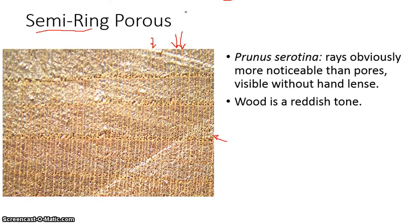Look for these rays that are almost blocking the view of your pore pattern, but once you look past the rays and see the pore pattern, semi ring porous means that the early wood has an organized band of pores that are pretty tightly packed. In the late wood they start to scatter more. The pore sizes are the same in early wood and late wood, but they are more organized in the early wood and more scattered throughout the late wood. That is what to look for with black cherry — the noticeable rays and the semi ring porous pattern with scattered pores in the late wood.